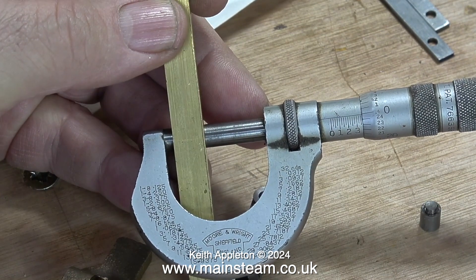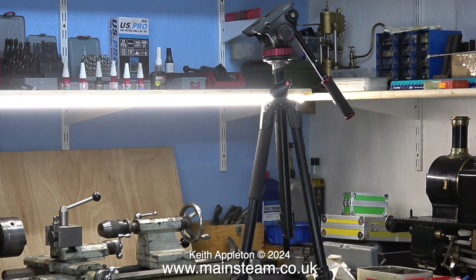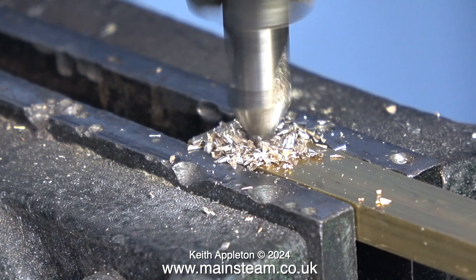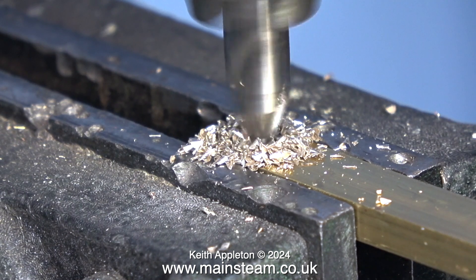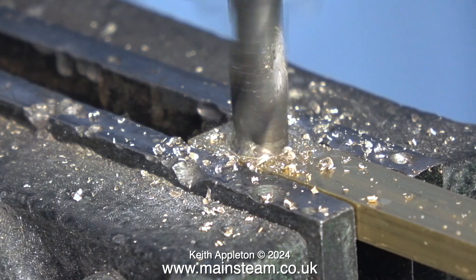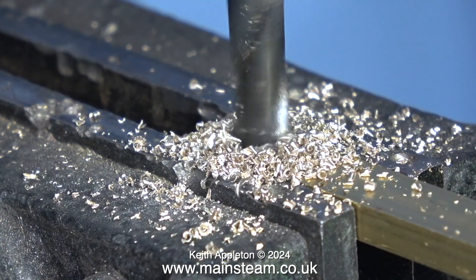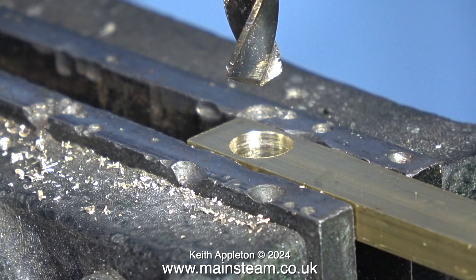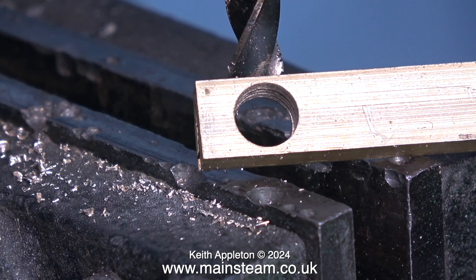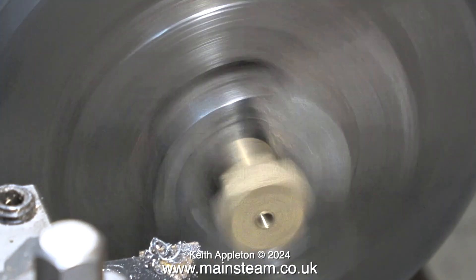I need to make the reversing lever, as that's one part that hasn't been made. Normally the reversing lever is a gunmetal casting, but I'm going to fabricate it using a piece of brass for the lever arm. I'm using a piece of brass I found — it's not quite the right size, but by the time I've machined it down it should work fine. As this reversing arm is a fabrication, I'm going to silver-solder a phosphor bronze bush into a large hole at the end of it, and with a bit of luck it's in the middle. Not bad, as I drilled this hole entirely by eye using no scientific equipment whatsoever.